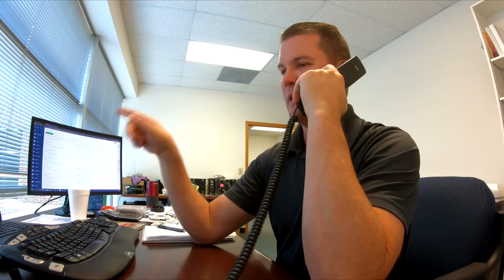So if you haven't marked off a course yet, like our instructions say, to get an accurate measurement, you can go out and drive and it'll actually capture distance for you right away. But to be extremely accurate, you need to mark off a 1,000-foot course and then start and stop the test from the beginning to the end of the 1,000-foot course. Whatever number pops up in the calibration display is your number. So it may not be 1,000, it may be 976 or 981 or 990. This all depends on the gearing of your car and the size of the tires.